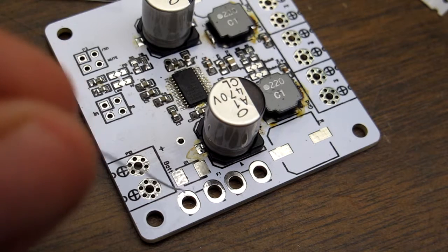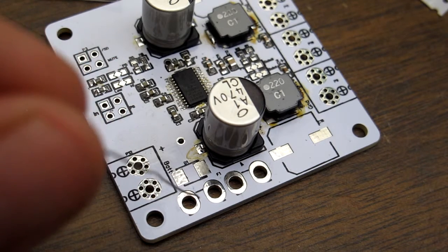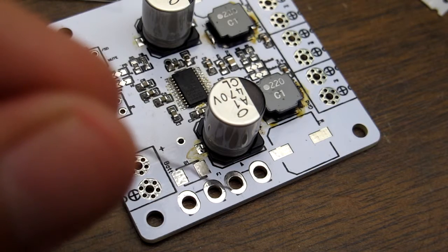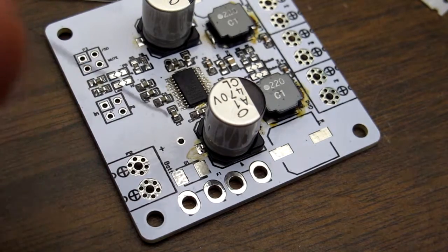But normally, if you were to solder these on, what you would do is actually put the fuse into the fuse holders, slide them all into place as a unit, and solder them. That way they will align perfectly, because otherwise you can sometimes get the fuse holders a little crooked from each other and you'll never get the fuse in.